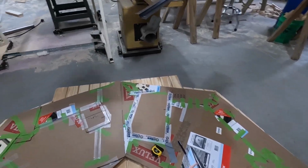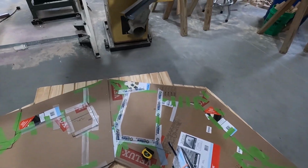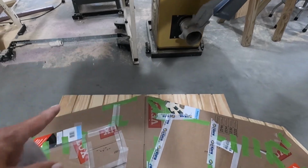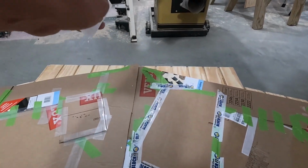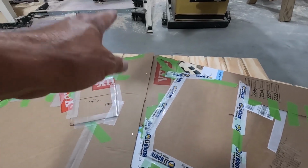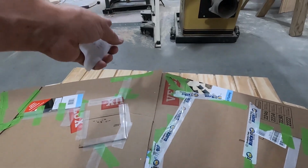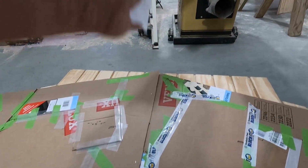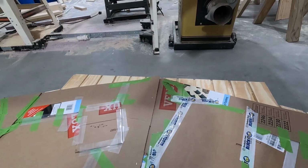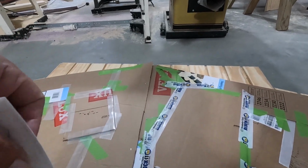Okay, yeah, because of the really sharp rake on this, I got to get this exactly right. And when I laid out these templates, I was thinking that there was a stud right down the center, and I laid it out accordingly. That's not the case. The studs are, well, the center part is open, and it's right in the middle of two studs. There's a full panel centered in the middle.